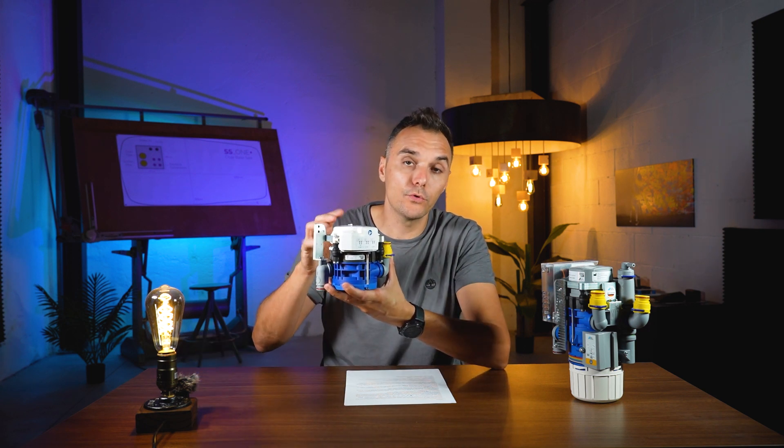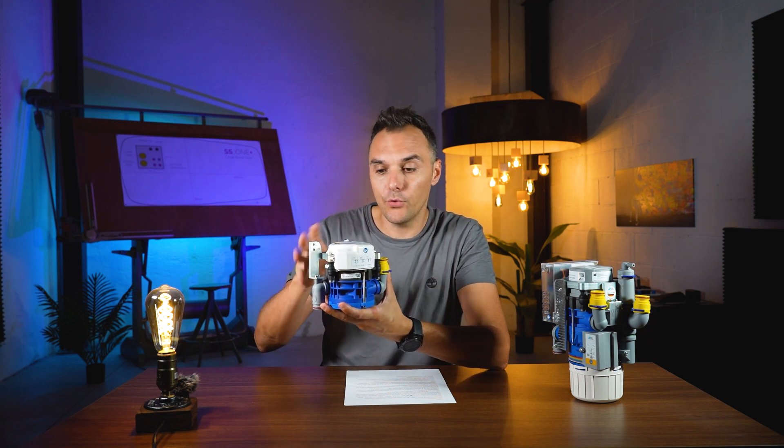There are different ways to separate air and water. One is to apply a separator inside the dental chair, which is the most common approach — for example, you can install the CS1 from DUR, which serves this purpose. Alternatively, you can apply an air-water separator inside the suction motor, but that depends on whether you have a drain system in the machinery room, since the separator needs to discharge the separated water somewhere.